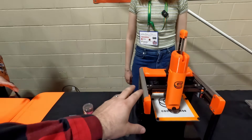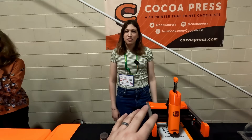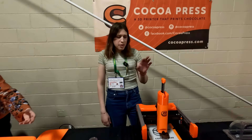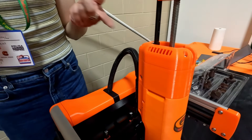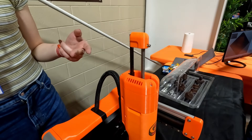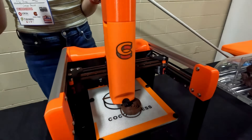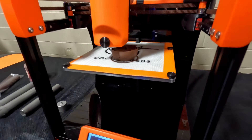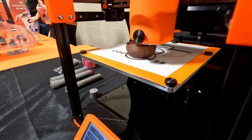This is very close to the unit seen at East Coast RepRapFest with a few tweaks. Nothing major changed — the biggest update is a couple of changes to the extruder to make it easier to assemble and to ensure the motor heat doesn't creep down into the chocolate, since the motor runs warmer than the chocolate heating temperature. They added a small thermal break to address this.